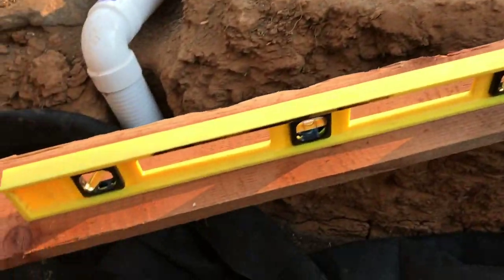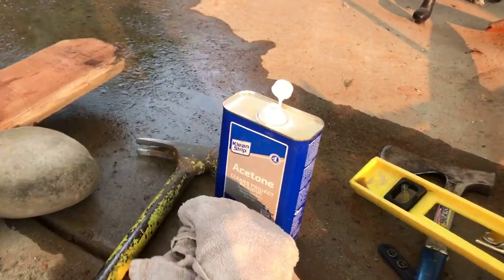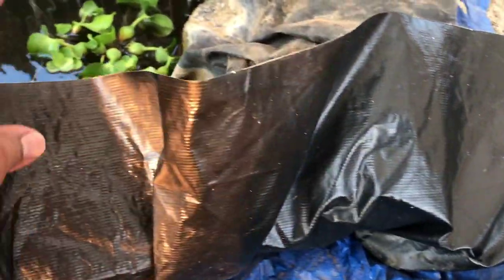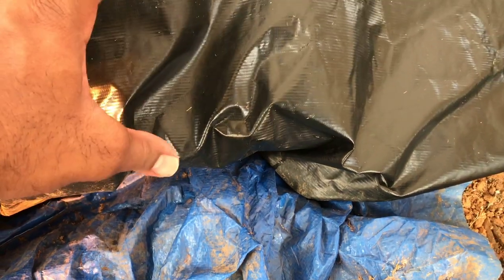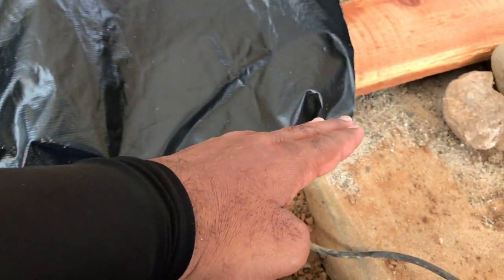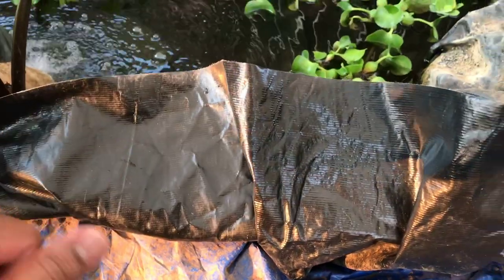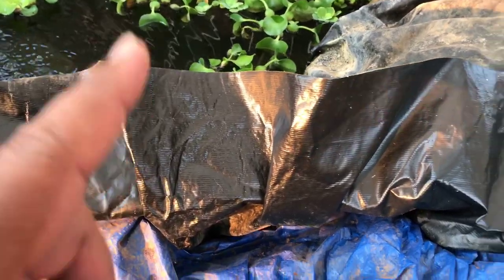That way your water line is even all the way around. As you can see, what we did was grab some acetone and a towel and we actually cleaned the bottom of this liner. Let me show you — the bottom looked just like the top side. What I did was clean about eight to nine inches from the edge up. As you can see, it is super clean, and you want it as clean and dry as possible so the new pond liner makes a nice watertight seal with the existing liner.